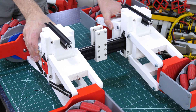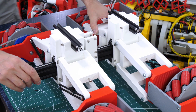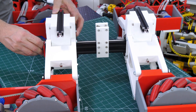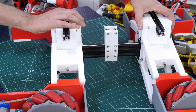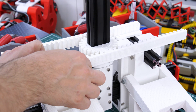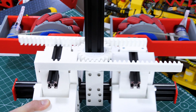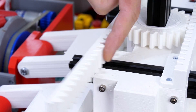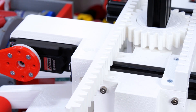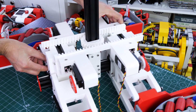My sliding section allows the wheelbase to extend so we can make it longer or shorter just like the real droid. The only problem is that the central piece doesn't stay in the middle — it slides off to one side because it's impossible to perfectly match the friction between the two rollers on the two sliding pieces. So to make sure it always stays in the middle, I've fitted a new piece to another section of 2040 extrusion consisting of a spur gear and two racks — that way it'll always pull out symmetrically and the middle piece stays perfectly centred no matter what. There is one challenge: those racks are quite bendy and might pop out of the gear, so another bracket was added which also holds the servo that's going to move the suspension. That constrains the racks in place so they can't pop out from the spur gear — held nice and rigidly, and it seems to be working pretty well.